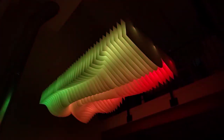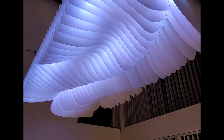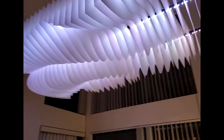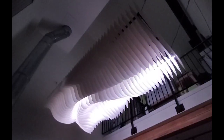Check out this light installation by Brian Harms. He calls it Light Swell, and it's an excellent example of how diffusion and texture can transform the look of NeoPixel lighting strip. What we have here is an Alexa-controlled lighting fixture made from 80-20 aluminum extrusion. Each aluminum beam has a strip of addressable LEDs with a generous spacing of 30 LEDs per meter. Spaced between them, you have these laser-cut sheets of cardstock that form a sort of wave pattern.